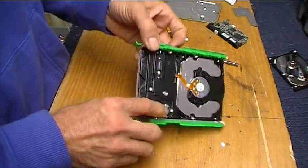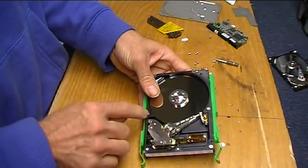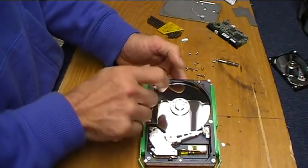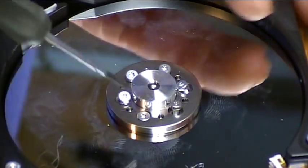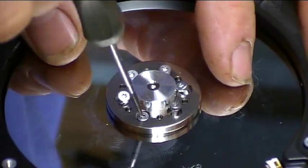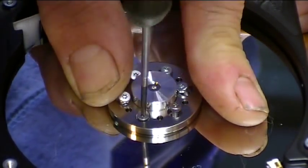Okay, what we got here now? Yeah, this looks like it's like the other one. This is all part of the frame. So I've really got to do some hacking, literally with a hacksaw, and cut away the frame so that this can stay mounted in it and I can have free access to this end. That means I've got to pull out all of this media. That'll be fun. Here's a little trick with some Torx. When they're tiny like this, you don't have a Torx bit, you can use a flat blade, because a Torx is basically 3 triangle shapes overlapping. So 2 of the points are across from each other. And if you've got just the right width screwdriver and you wedge it in there good, you might get lucky and get it to turn.